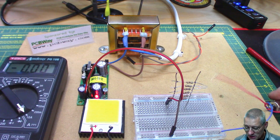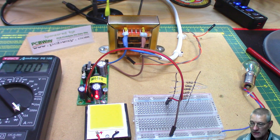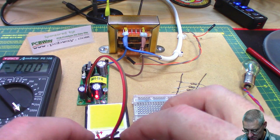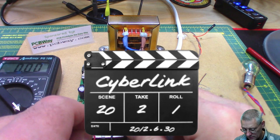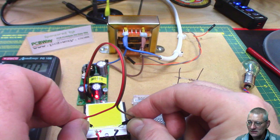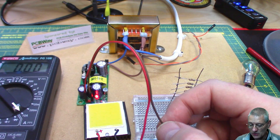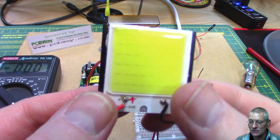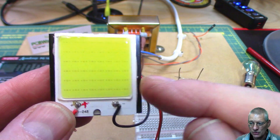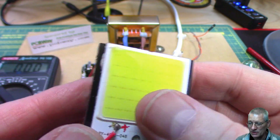So we knew that wasn't going to work because this bulb takes 2 amps. What about this 12-volt LED thing? That is incredibly bright. If I connect these up — negative, positive — whoa, look at that. That's bright. I've got spots in front of my eyes. But it's no good — do you know how much it drew at 12 volts? 80 milliamps. If you boost it to about 13 volts it takes around 200 milliamps. Can't use that — it's far too low a load.